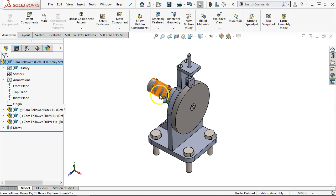And so I went with an oversized coupling, but I don't know if the coupling's too stiff. So as the motor starts to slow down and it has to overcome this rotating mass, this coupler is intended to take up some of that compliance, not necessarily to be a brake, but if the motor comes to a sudden stop and all of that momentum has to go somewhere, this allows enough compliance that it's not going to basically tear out the guts of the motor, at least not immediately.